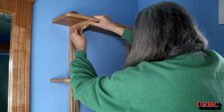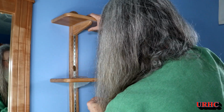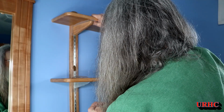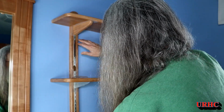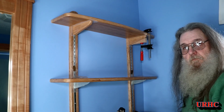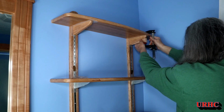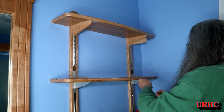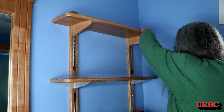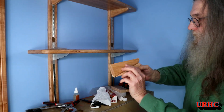And you can see once you get that cover in place, you've got nice adjustable shelves, and they really don't look that ugly like the cheap brackets or the big double wide metal brackets or anything. And if you really want to hide the upright, you can just cut a thin slot in that upright piece of wood and put them in from the back too. So you won't really see anything, but I kind of like doing it this way. It's easiest for me to mount.